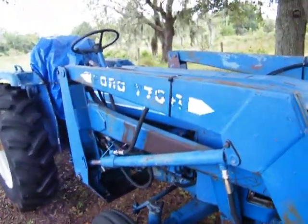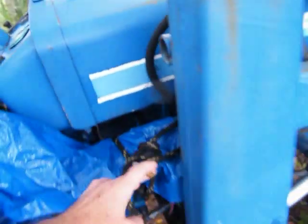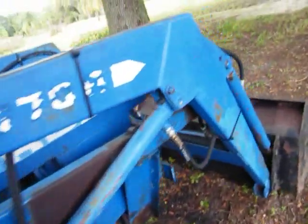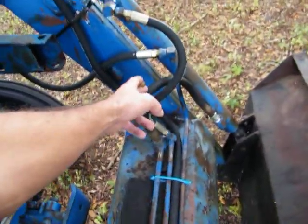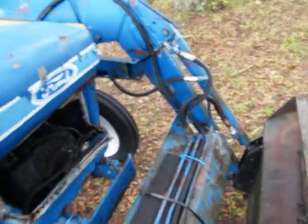So now I'm gonna get hydraulic filters for it, and I got four hoses here I need to change — they go down to the rad joystick. They didn't have that hose, so I need that one too, so it's five hoses I need to get really. Then they'll all be changed — cool, it looks good.